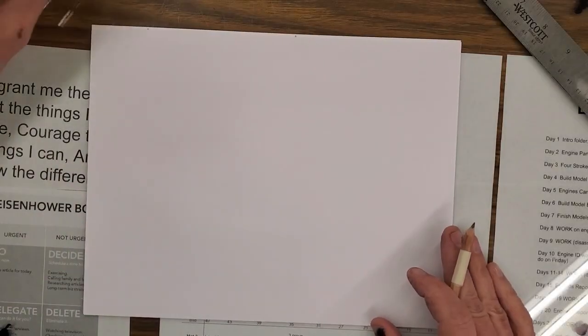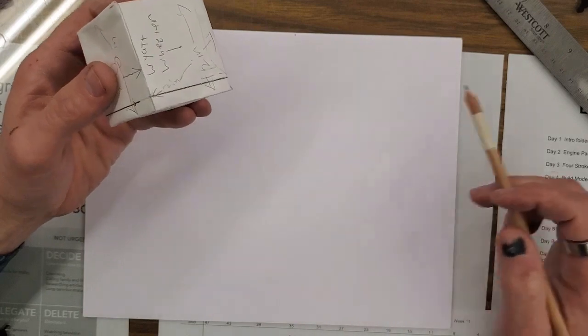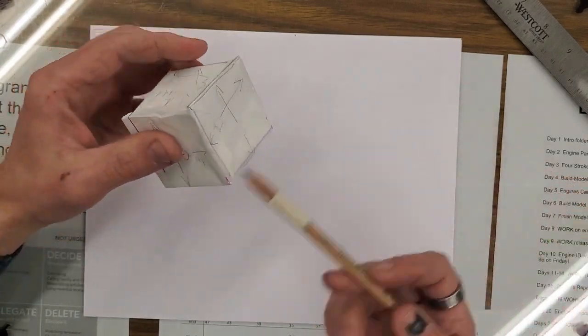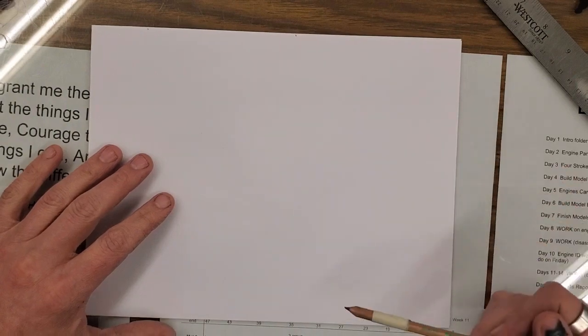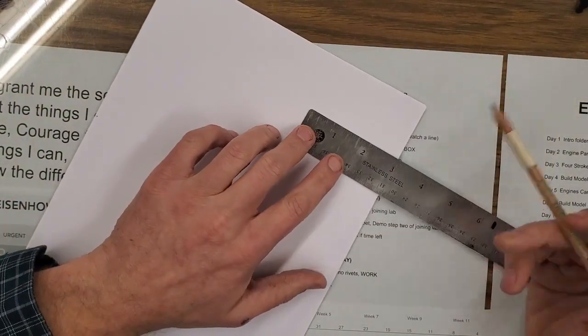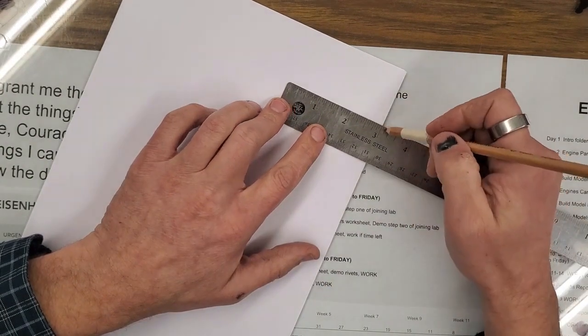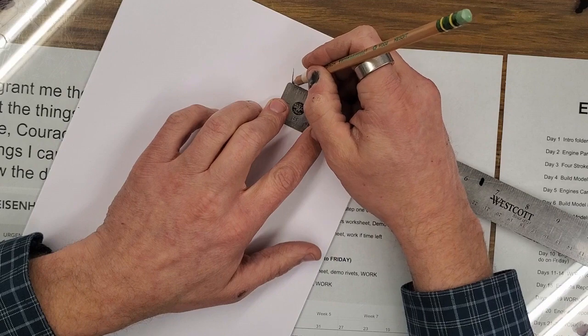The cube is a two-inch cube — two-inch square, six sides, six surfaces: four sides plus the top and bottom. The first line we do is going to be three inches up, so I'm going to set my ruler. You can do it backwards this way — I'm going to put my ruler at three and go to zero, remembering that zero is not the edge of the ruler.